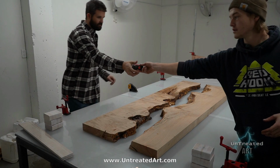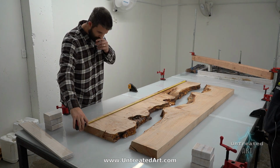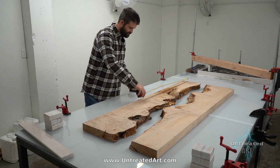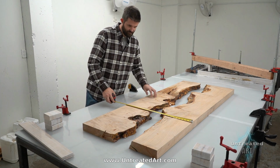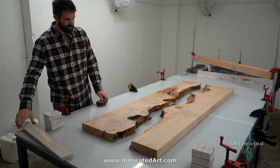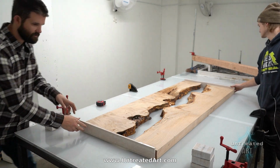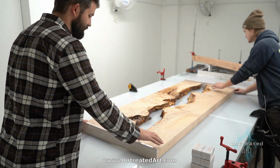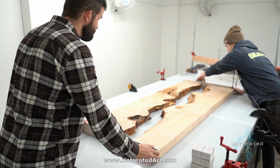Okay, before we put these beams down, let's make sure we're centered. Once we put this down, it's not moving. It is there for several weeks. So 70, 35, yeah, that's good. Double check, I always double check. So we'll get off a little bit. Now we've already cut our epoxy dams to the right size. So go ahead and put that one down there. Put this one here. And now we can push these slabs out to match the edge of these dams, because we know they're exactly 26 inches. So we'll slide it a little bit.